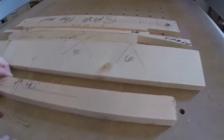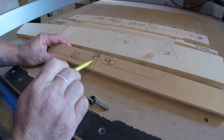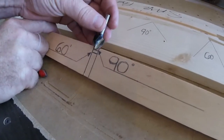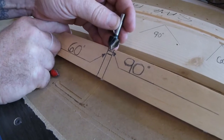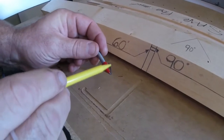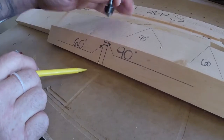Here's an illustration of the difference and how they work in Carbide Create. If you have a letter or any other object you're making a sign with, given a certain width: if you choose a 90-degree V bit it will plunge this far to achieve the edge of the bit touching the edge of what you're trying to gouge out. A 60 will go in much deeper to achieve the same thing — it's trying to line up the edge of the bit with the edge of what you're trying to cut. So when choosing your bit for V carving, be aware that a 60 is going to bury and a 90 won't go in quite as far.